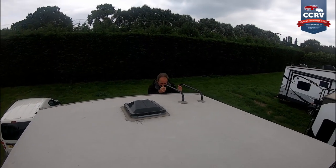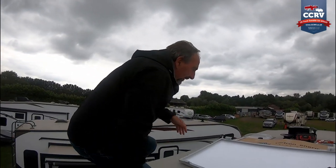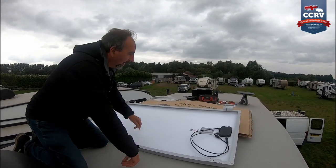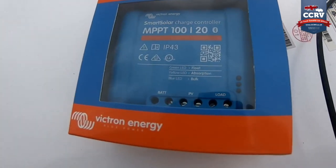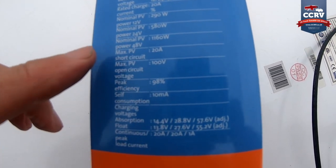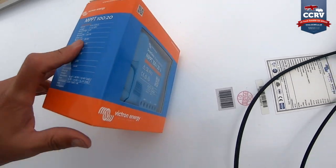I'll get up on the roof and show you the panels. We're going to show you some of the solar panels we actually put on the roofs of these fifth wheels. This is a typical roof of a Rockwood - there's plenty of room, you can actually stand up here. Now these are the panels we use: the Victron - Victron Energy - and they're 215 watt. That couples up with a Victron smart solar charger, and this particular model is rated at 24 volts. This charger will take up to 580 watts, so with the two panels we've got 430 watts - that's plenty. This is a typical layout.